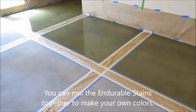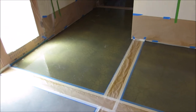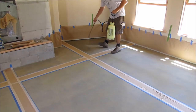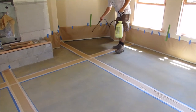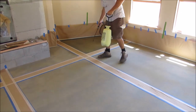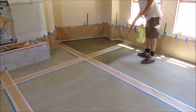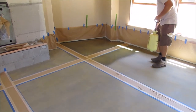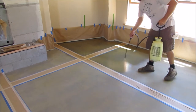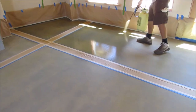So that's going to dry out and we'll get another coat on it, then we'll seal it. We're going to apply a light second coat of our endurable stain, and we're still going to get a semi-transparent look. This concrete was ground at 40 grit, and there was a curing compound on here, so you have to get that compound off. Otherwise, the stains will not penetrate — they can sit on top, and you'll get a very inconsistent, blotchy look.